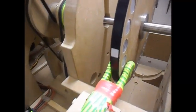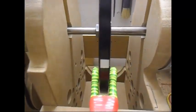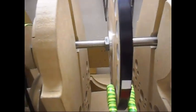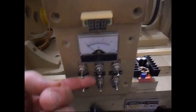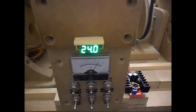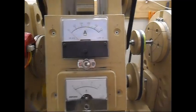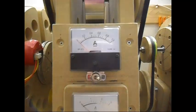Today I'm going to show this squirrel in a high-speed RPM test. The unloaded RPM is going to be around 2680, something like that — 2650. I'm going to run the system on 24 volts input at around 1 amp, something like that, and between 800 milliamps to get it started.